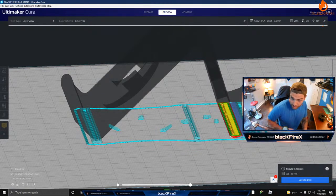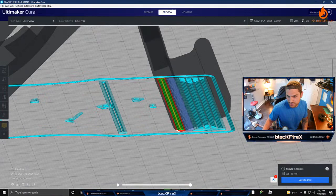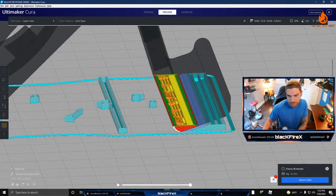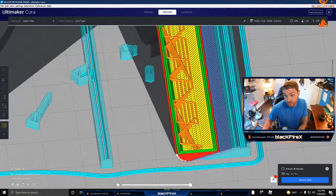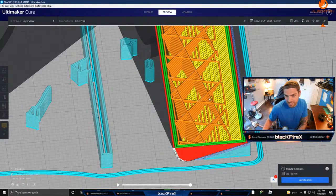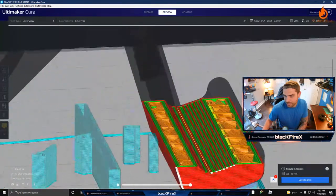We're now on the 5th layer. Now you see here, we're gonna start doing some infill. So it's not gonna just be solid, see, this was solid. Once we get to the 5th layer, we're starting to open this up because we did a 20% infill. That saves some of our plastic and it's still great strength with this cubic formation it puts in here. It's basically the Star of David. Do you guys see that? Kind of cool, right?